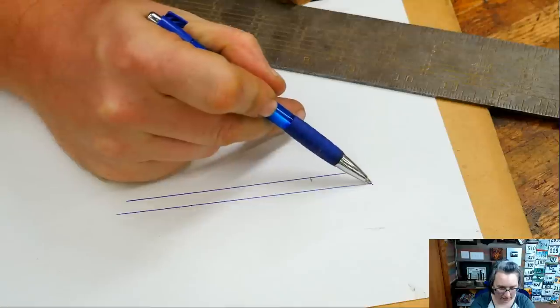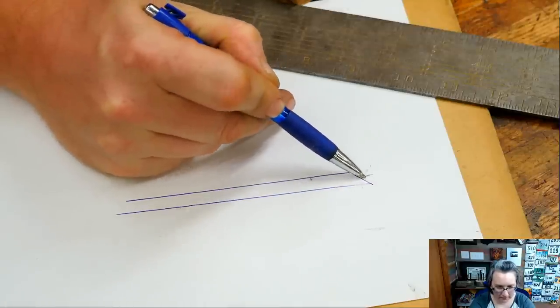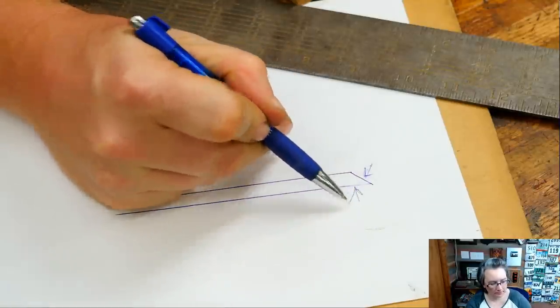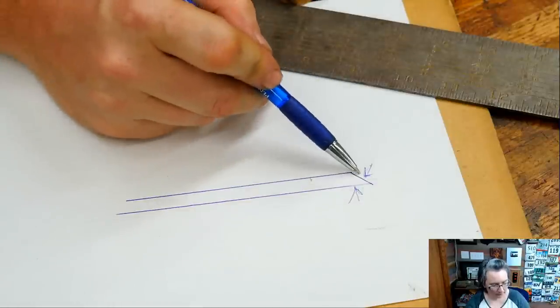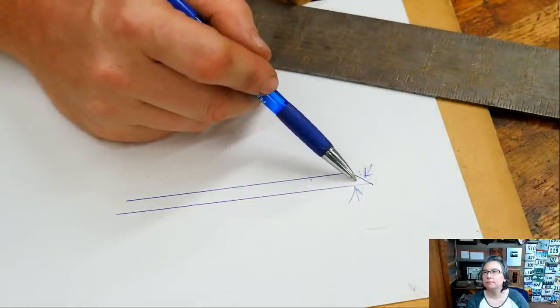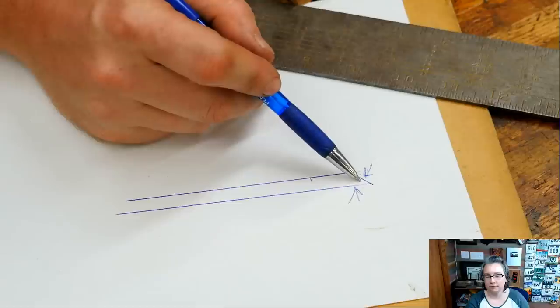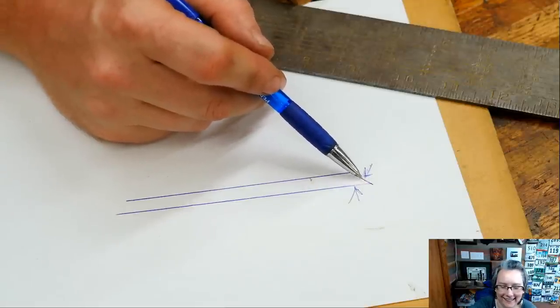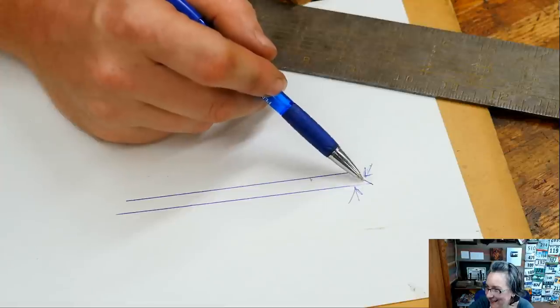And so we want to take material off of this face. And one time we want to take material off of this face. So if we just continuously take material off of this face, the bevel here, we can slowly bring this bevel back. And every time we bring the bevel back a little bit farther, we'll get a new edge, a new keen point right here on the very, very tip. And so that's what we're trying to do, is get that point incredibly sharp.